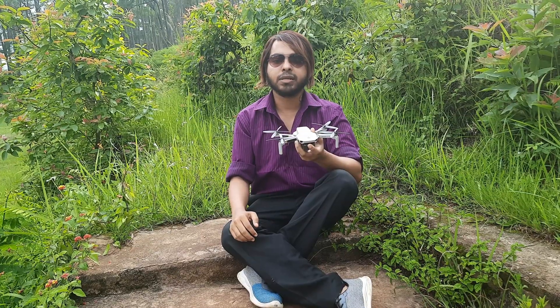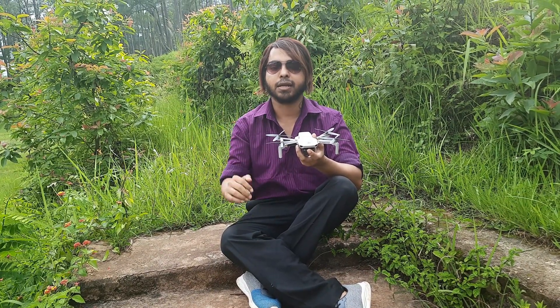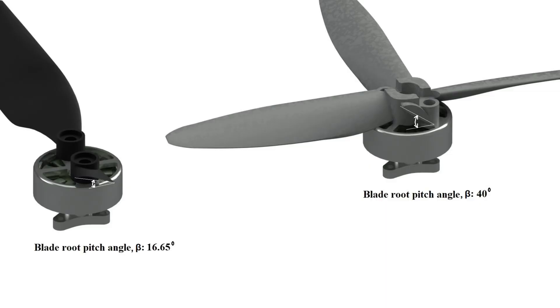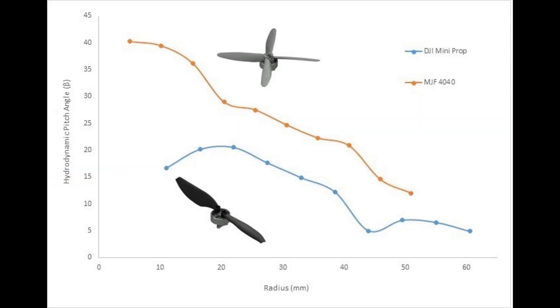The second term is twist. In most ideal propellers, the twist rises to a more shallow or negative angle towards the tip. Twist is a distribution of pitch angle along the length of the propeller. You can see that the 3D printed propeller has a different twist slope compared to the original one, and this changes the lift distribution along the blade, which in turn reduces the aero acoustic signature.